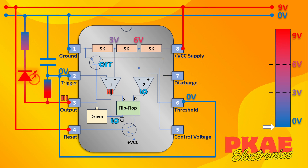So let's take a look at how this circuit works. As in my previous video, I'll use this voltage scale on the right-hand side — red indicating your supply rail which we had at nine volts, and blue your negative rail or zero volts, with all the gradient in between. This arrow here indicates the charge on this plate of the capacitor, so it's the same voltage that would be all around that leg as well.